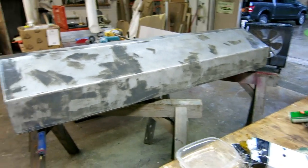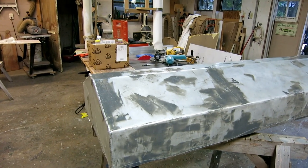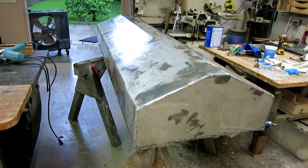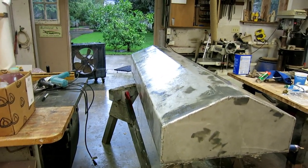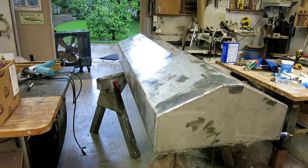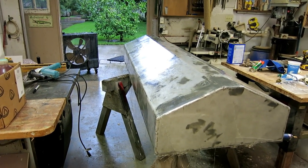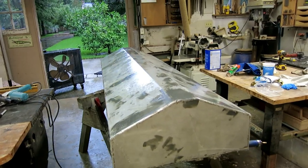Either the camera quit or I didn't hit the start button — I can't tell right now, but I got it all on there. I worked myself crazy, and I really didn't need to because this epoxy sets much slower than what I've been working with, so I had plenty of time. I got a good layer of cloth everywhere and the corners came out pretty well. I'll let this cure, sand it lightly, and I'll probably put some one-inch fiberglass tape on the corners, then flip it over and do the top. The tank did not leak; it did have some corrosion on the outside, so I prepped the corrosion with thickened epoxy just to slow down any further corrosion, and then covered the whole tank with epoxy and cloth for an extra safety factor. I'm going to cover the top and then paint the whole thing with epoxy paint — it should be good for another 30 years.